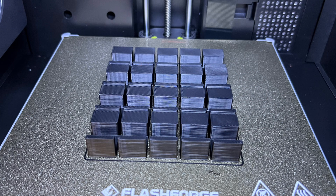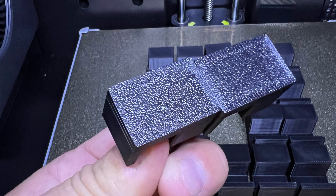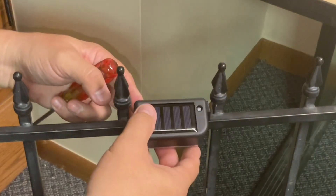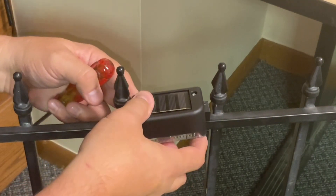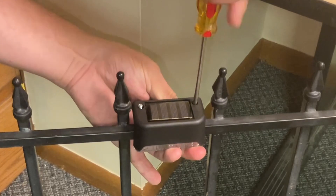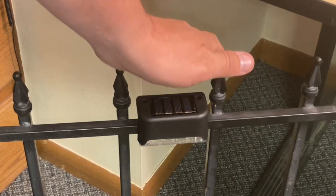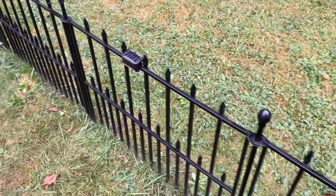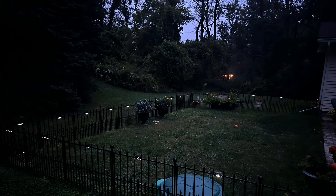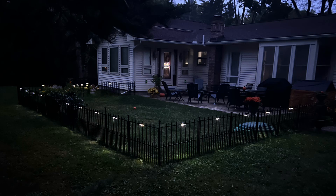The first one was printed at a 0.28mm layer height, which is why it looks a little rougher. I also printed more at 0.2mm and the bottoms all look nice and flat with no warping, which was great. The design required printing with layer lines in line with the holes, so I was worried about splitting the plastic — and I did split a couple — but screwing in really slowly kept most intact. They fit nice and tight, the lights worked perfectly, and after installing them all on the fence throughout the yard it looked great at night. It lit up the edge of the yard nicely from every angle and, best of all, my wife loved them.